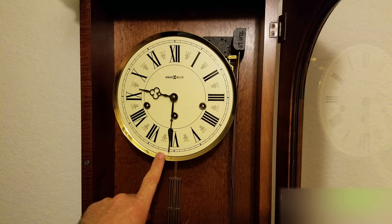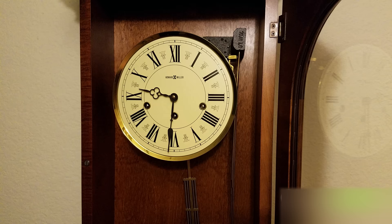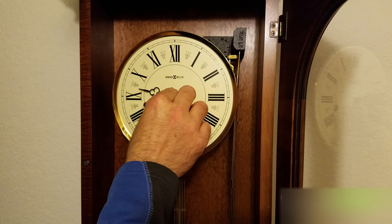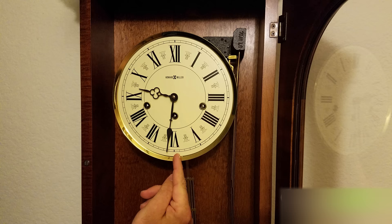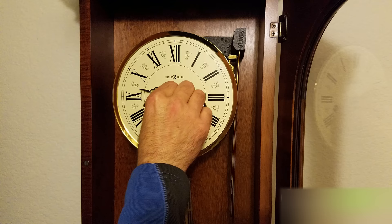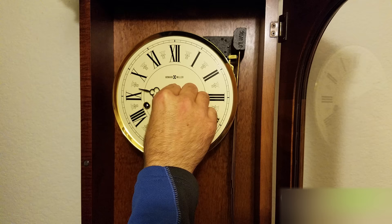Fixing this is a pretty easy thing and something you can do at home. If you had a cuckoo clock, what you would do is undo the center nut after it hits the 30 and you hear it do its cuckoo, then unscrew the center nut and let gravity let the hand sway back and forth and stop in the middle, tighten it up, run it up to the top of the hour, and it should hit on the dot. For most grandfather clocks, wall clocks, and even some mantel clocks, you can't do it that way.